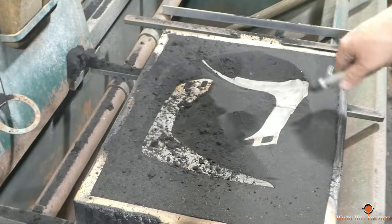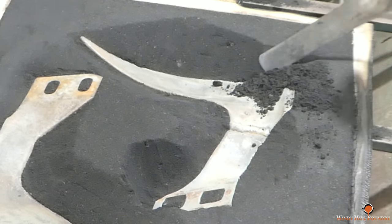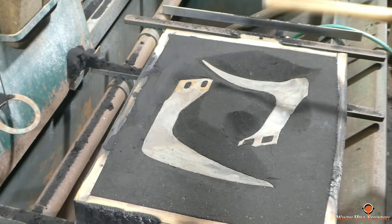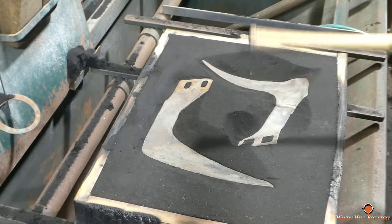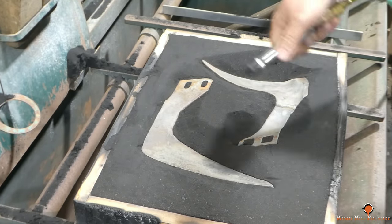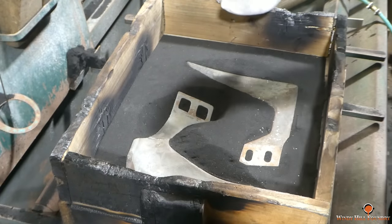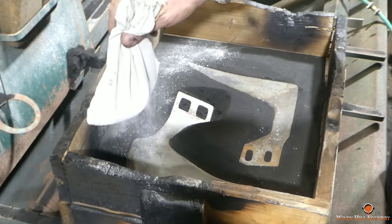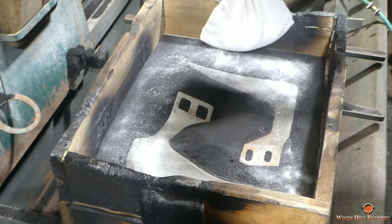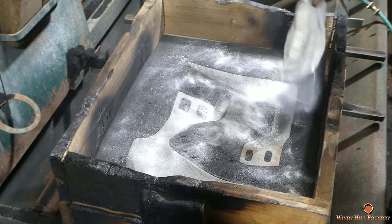Now, I'm going to modify these. I've got a problem with the plow you see on the right, in the upper right. That scrubs the inner part of the can, and it's got a radius down there in the corner that's leaving a circular ridge that doesn't get cycled back around. Along with that same plow, the cutting edge is only about 6 inches high on the vertical end, so it's leaving a collar of sand stuck to the drum that doesn't fall off. It just stays stuck there. So I went ahead and increased the length of that cutting edge on the vertical part all the way to that interface, or where you mount it.